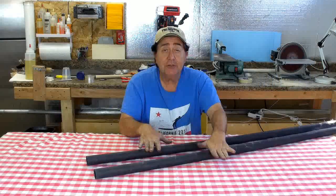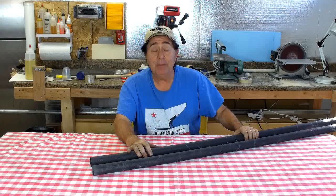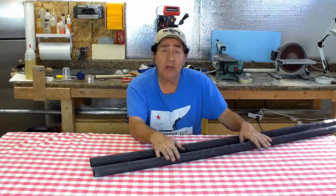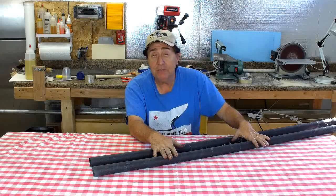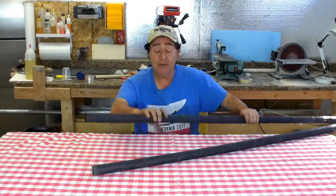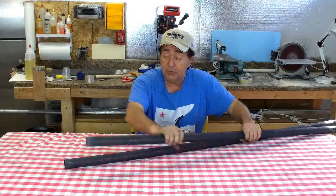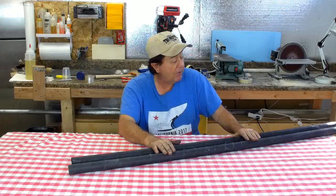Welcome back. The two leading-edge tubes are done — it's actually the next day. I ran the second one at slightly lower temperatures, between 150 and 170 degrees, and I think it came out a little bit better. There isn't so much variation in the compression of the tube from the heat shrink. The surface is smoother on the outside, which is good. So lower temperatures — probably okay.